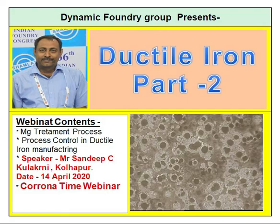Next thing is time between magnesium addition and ladle tapping. As I told you, it is very important. Keep an eye on the person who is putting the magnesium. Give him a call that now metal is ready, tapping temperature is just about to arrive, and put the magnesium. Unless and until you give that call, he is not allowed to add it. It's very important.